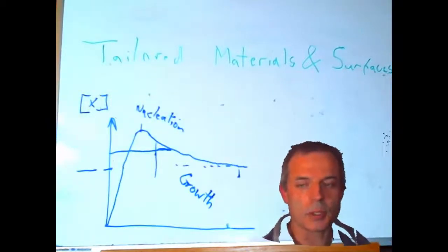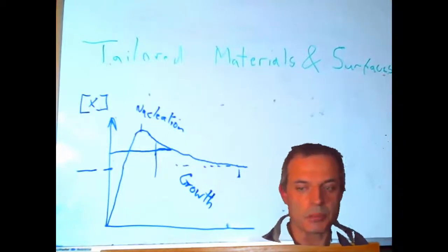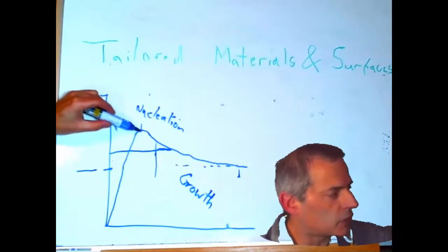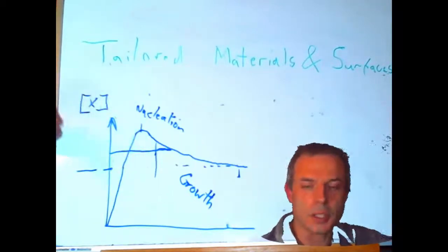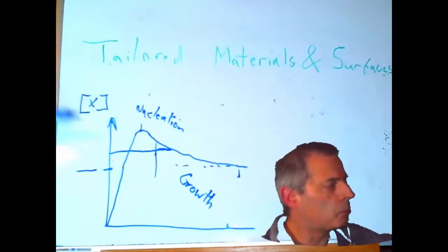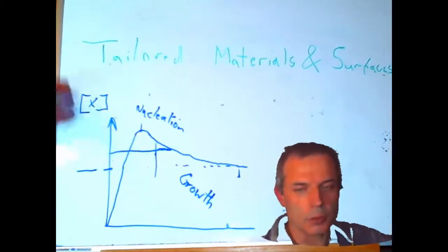Obviously, an electroless deposition bath is not stable, so we can't keep it for ages, because the moment any particles grow in there, its concentration of, well, we had copper, will go down to the saturation concentration and it won't have any ability to coat anymore. But they are reasonably stable. We can put things in there and grow particles.